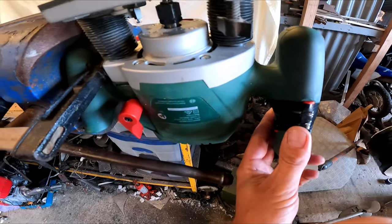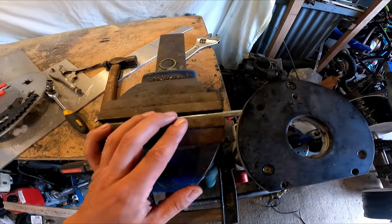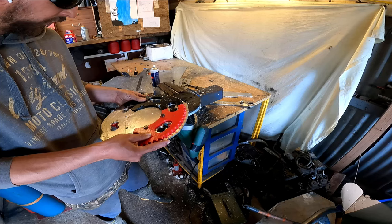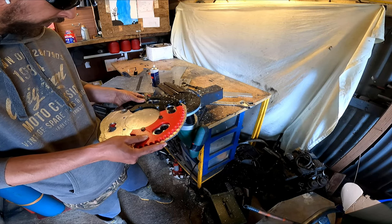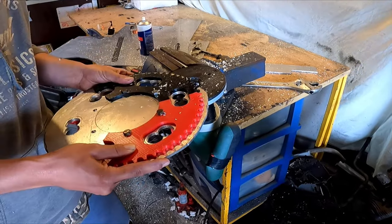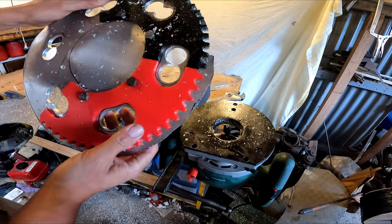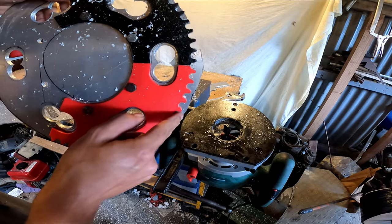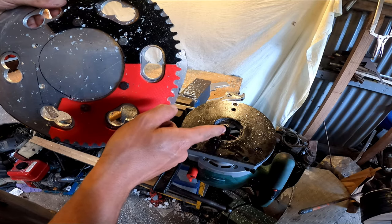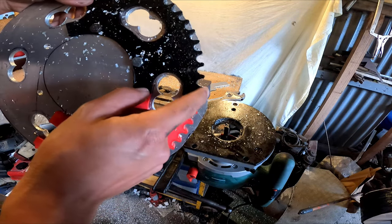I have to tape off the trigger and then just plug it in, clamp it to the vise with the sideways bar in there. This is actually working pretty good. Problem is there's quite a lot of material to take off, so I've changed the cutter to just a normal one that's a bit bigger, to wipe some of this off first and then I'll go back to the small cutter.